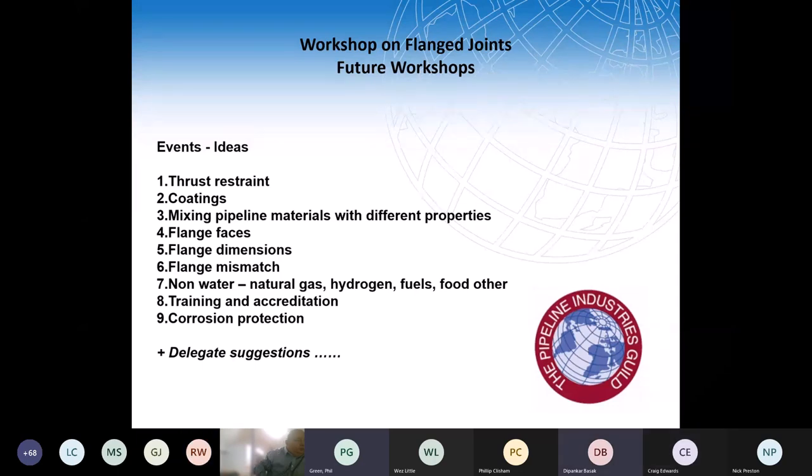Absolutely. Generally for pump houses or pumping systems, we tend to have some flexible joints, like bellows, which isolate a lot of vibration. But I did have an experience of GRE, a glass reinforced epoxy pipe, failing in close proximity to pumps. Flange failure. That's a cyclic load failure. It does happen, but quite rarely.